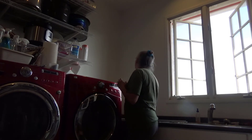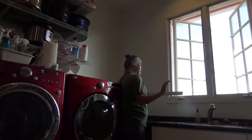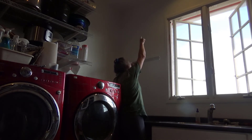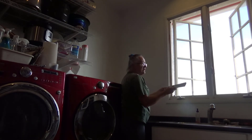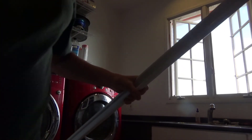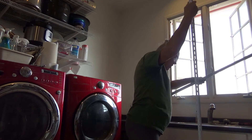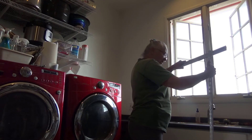Got the basic cleaning done. What's going to happen now is I'm going to get a ladder. This bracket is going to go way up there by the ceiling and it's going to be screwed into the studs wherever it can be, and where it can't be I'll have to use toggle bolts to attach it to the wall. And once this is in place, these verticals will hang on here.